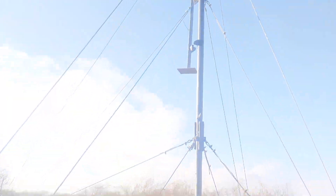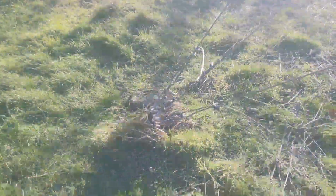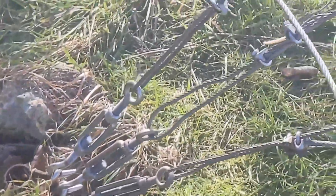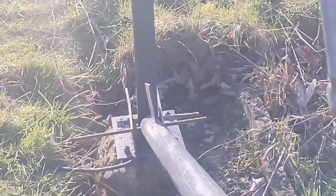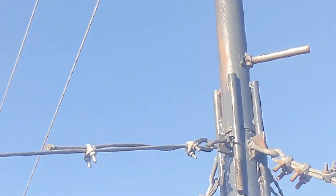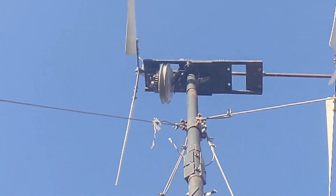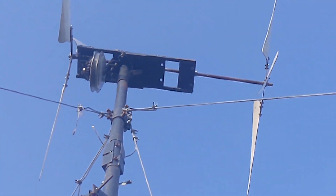The downside of the tower is that I made it in an extreme hurry and it's not accurate at all — the fittings aren't in the exact places they should be. So when I put the tower up I have to slacken off one side to stop it over-tightening, and tighten them again when it comes back up. It's a bit of a pain, but it's super solid. It was made from scrap tubing I got very cheaply. The good thing is how solid it is and how little it cost; the bad thing is it's not very accurate. I did weld some bolts on as steps, but I'm a bit too old to be climbing those. Everything on the tower is homemade. Up top there's a bracket holding the four top guy wires. The offset blades are used to pull the turbine into the wind — that's the idea, though it needs further work.